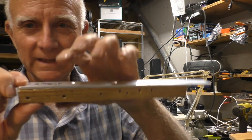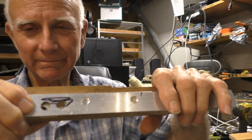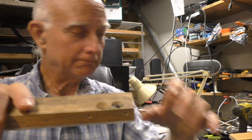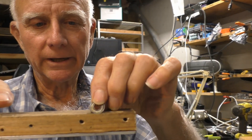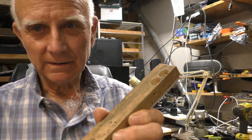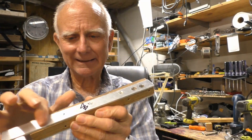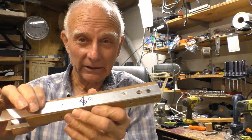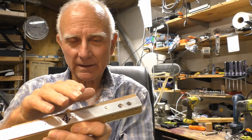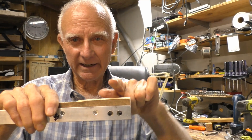This side has an aluminum plate to keep the bearings from falling out while you're drilling, so we do the same thing on the other side. The aluminum doesn't have to be aluminum — it can even be lumber or plywood — but this holds the material up against the fence so when your drill goes in it'll be straight and not at an angle.